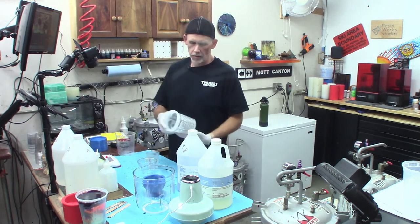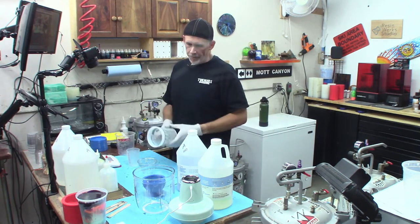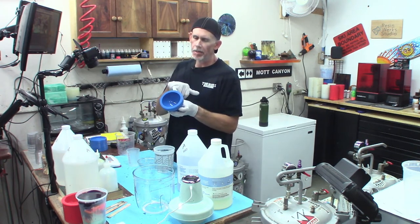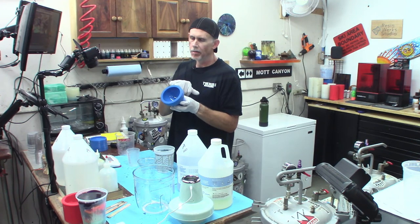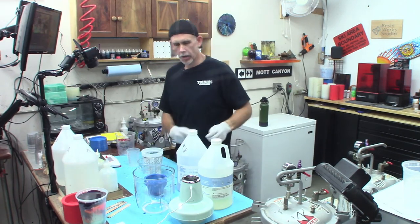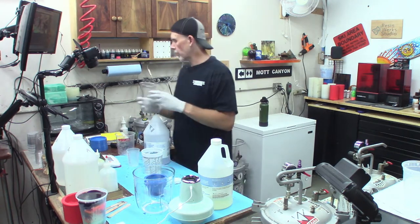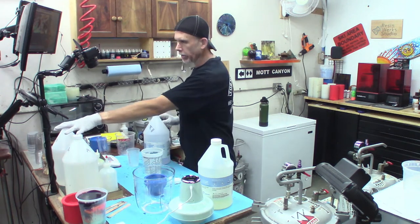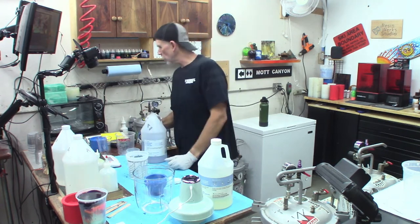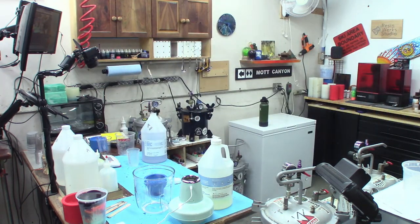So let me get my mixing cup ready. I have no clue how many ounces that thing's going to take. Does it say? See, Philip Danner, he knows. Okay, so it's 10 and a half ounces. Is that it? Huh, okay. So we're going to mix up 12, just to make sure we have enough. Now, this resin is a 1-to-1 by volume resin. We haven't talked about this in a while because I'm usually using Alumilite Clear, which is by weight. But this one, you need to measure in a cup like this. So, do I have a smaller one? Yeah, I do. So we can get away with using one of the small ones.